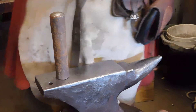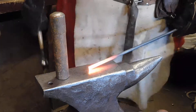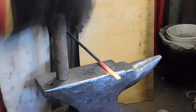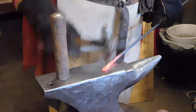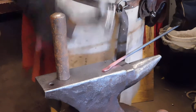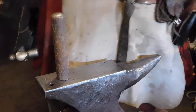Starting off with a piece of 10 mil rod. This is just going to be a basic little eating spoon for the kids that we're making. So first we get a nice hot flat out the end, flare it out a bit, going to neck it a bit, like so. Then flare it out. I'm using the back side of the hammer that way we actually put little dimples in, like so. It actually spreads the metal so it makes it more easy and pliable to move around.